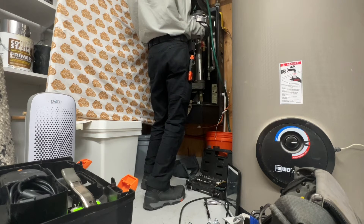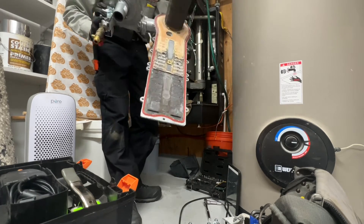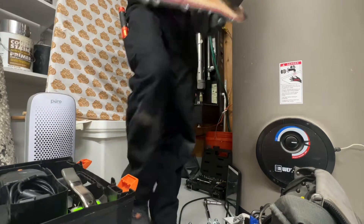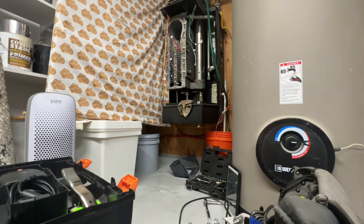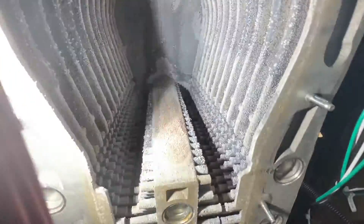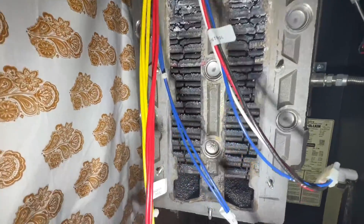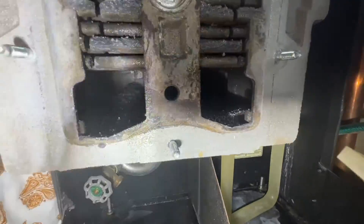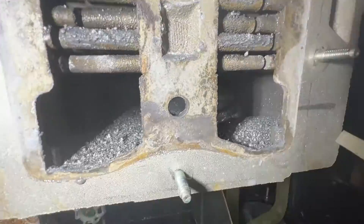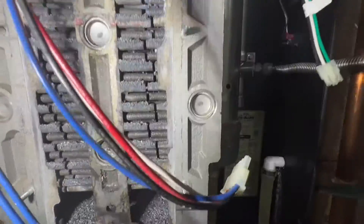That's a good look. I don't know how well the camera can see it, but that'll be cleaned and the gaskets replaced. Let's see if I can show you the inside of it — the flashlight turned on. Pretty bad, actually. You can see how all wet this is — it's like glistening. That's because it was all filled with water from that clogged condensate. All the debris back in there. Pretty nuts. So we'll get this all cleaned up.